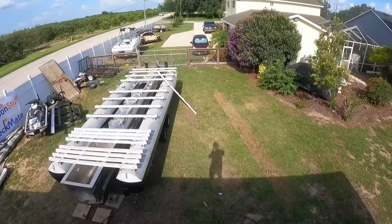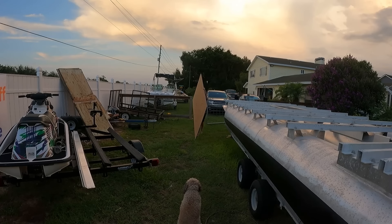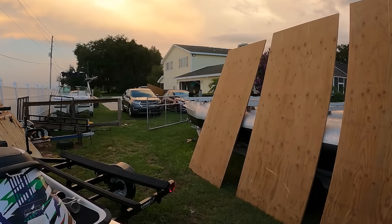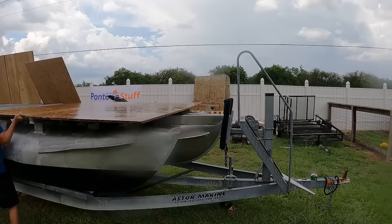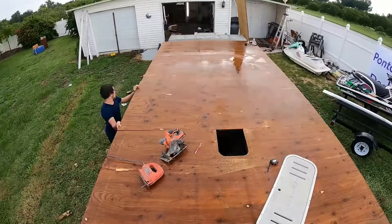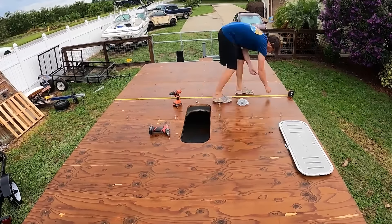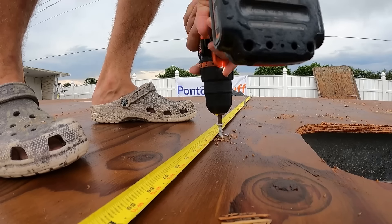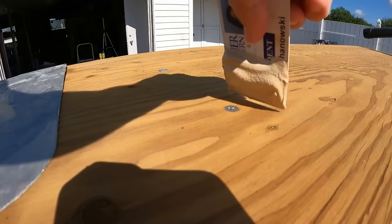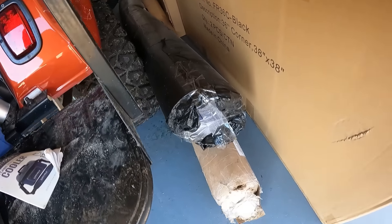Time for the flooring. I was sponsored by a couple people on this build — Pontoon Stuff was a main sponsor so they sent out all this stuff. Their whole kit costs about $1,803.70. They send out the flooring material, the glue, screws, decking, and wood. I only used half the vinyl flooring because I was going for a different design — I used half the woven vinyl flooring and then regular vinyl flooring for the back. I filled in all the holes with some putty, sanded it down. The good thing about the woven vinyl is it's like a little foam pad, so it hides a lot of imperfections in your wood. It also feels really good on your feet, easy to clean up. I love it way more than carpet — carpet on pontoon boats kind of reminds me of carpet in a bathroom.